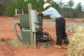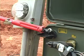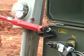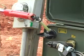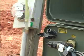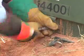Journeyman line technician Larry Johnson kills the power to the work site by using an insulated stick to move the fuse from the underground transformer. Even though he'll be nearby, Johnson bolts and locks the transformer to prevent any unauthorized entry.